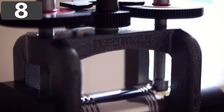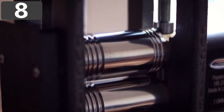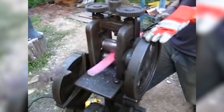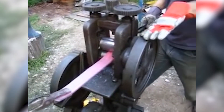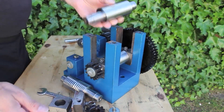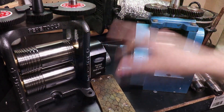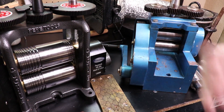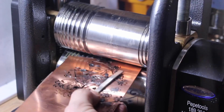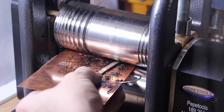Number 8: Rolling Mill. Rolling mills are hand-powered machines usually seen in small jeweler workshops. They have steel rollers operated by a handle and will change the gauge and shape of the metal being passed through them. This can, for example, be used to change a circular piece of metal into an oval one, and is ideal for working on intricate custom designs. Halving the thickness of a piece of metal will almost double its length, but it won't happen instantly — it'll need to be passed through the mill a few times.